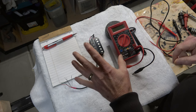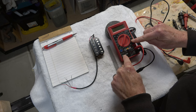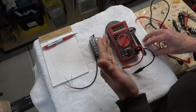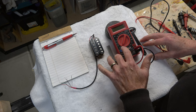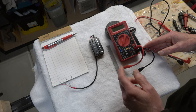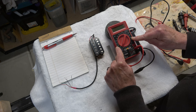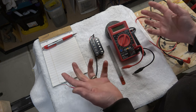The tools necessary for mapping out a pickup are a digital multimeter — just a very basic one. As long as it can measure DC resistance at 20,000 ohms, it'll work. Some guys like to use a multimeter that can measure microamps, but I'm just going to stick with DC resistance. Almost all multimeters can measure DC resistance at 20,000 ohms, and I purchased this one at Harbor Freight for less than $10. I'll put a link in the description below.